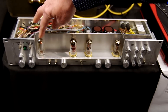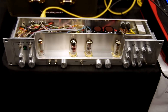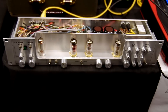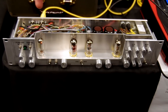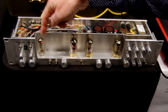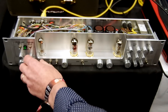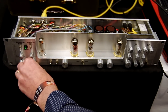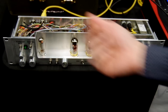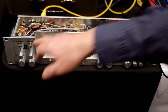The whole thing starts here with an oscillator — kind of a sawtooth, a relaxation oscillator — and it's done in a gas discharge tube. As a bonus, you get a nice little lightning when you play, a nice discharge. So this is triggered. Now it's in the position where it's just stopped, and I can trigger it with pulses derived from the MIDI signal.